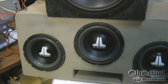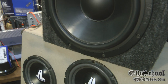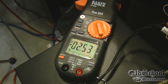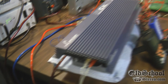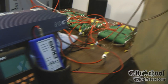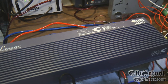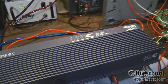Here's one of the most interesting parts of all this — these subs are absolutely thumping right now, hitting extremely hard and shaking the whole old school stereo lab. Check out the amperage — we're only peaking at about 10 amps of current. This is what I was telling you guys: test tones really put a strain on an amplifier and pull the amps hard. But if you're playing music, even bass-heavy music like this, you're good — you don't have to have so much amperage reserve.